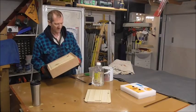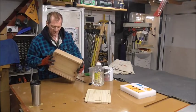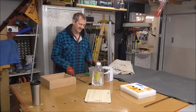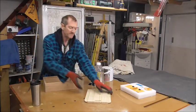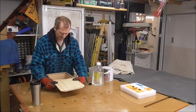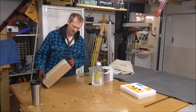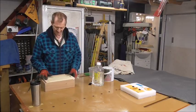And it's all sanded down, filled in a little bit just to make the joints disappear. Give it a good sanding down. Now I just want to do a bit of polyurethane varnish because it's going to be in the van, so it could at times be susceptible to a bit of damp. So it's a yacht varnish I'm using.